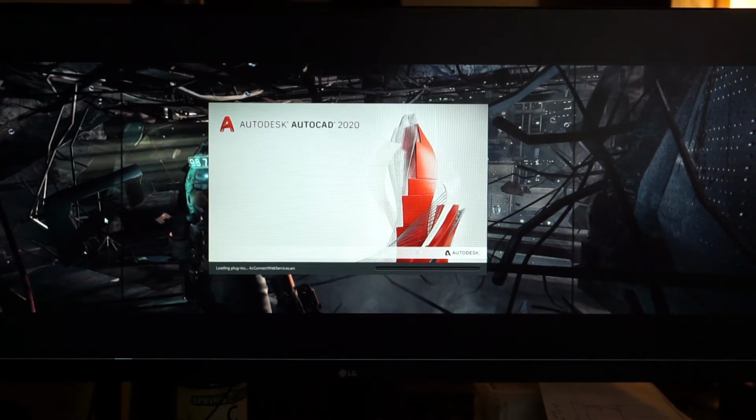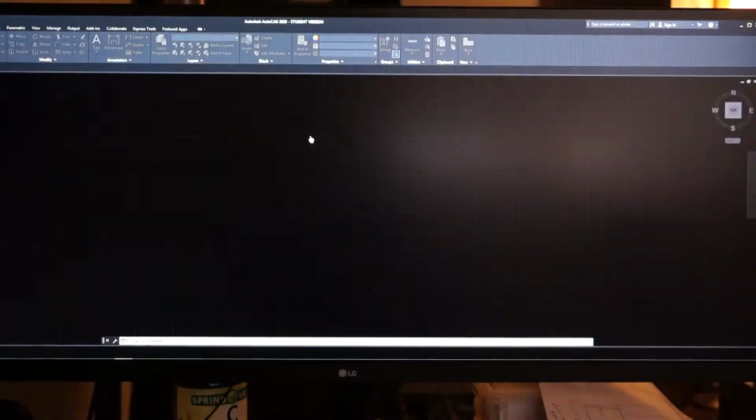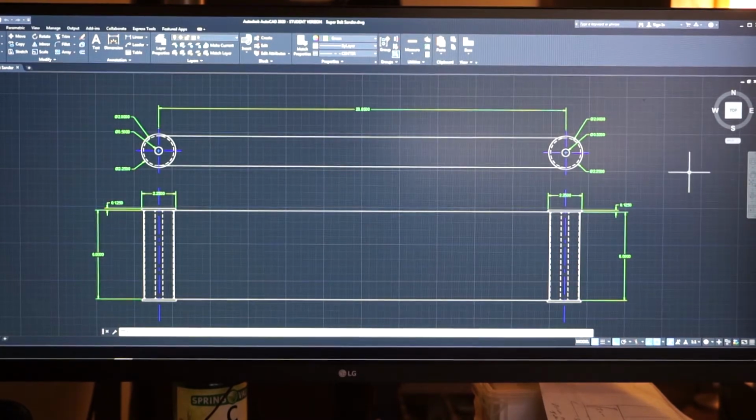Literally just got off the lathe. Just turning down a piece of 2-inch round bar of aluminum, just basic 6061, putting little lips on the edges so a belt doesn't walk off, but enough flat spot where I can track it. Tracking being the fact that you gotta get the belt to run a certain direction. In this one you're gonna notice it's like 6 inches here. Not technically gonna run a 6-inch belt, turns out. I'm going to run a 4-inch. Probably run 48 inches long. Generally, this is the gist of it.